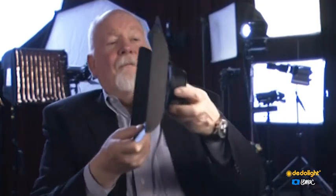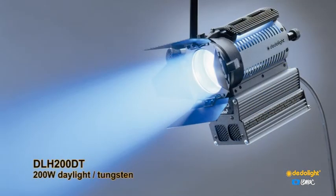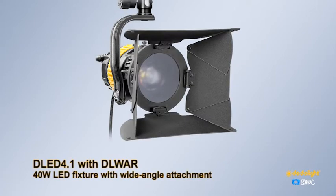And this is it. It will go very effectively on the 200 watt HMI, which now also is a tungsten HMI by lamp change. And you could even use it on all the classic Dedolights. But of course, when you spread the angle to go a lot wider, the light intensity in the center will drop. So then people say, how much light do you lose? Well, we're not losing very much. We're losing less than 10%, but still we're spreading it a lot wider, so it goes a little darker. So we're at the lower end of light intensity. And that's why this is not always, but very often used with the 200 watt HMI or the 200 watt tungsten ceramic light, but it can also be used with any of our classic lights.